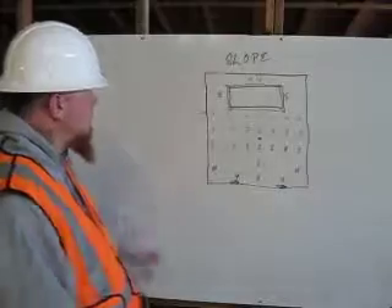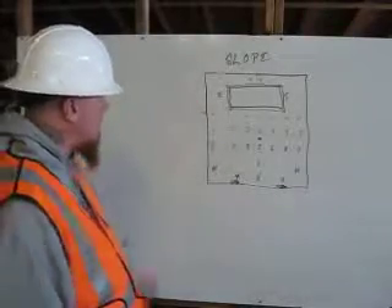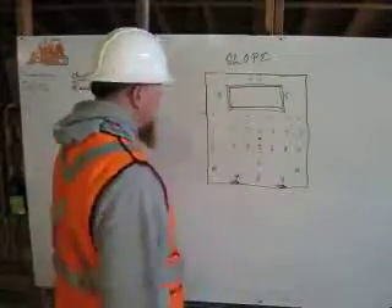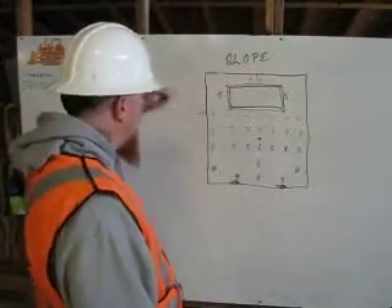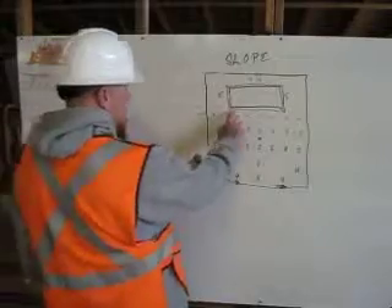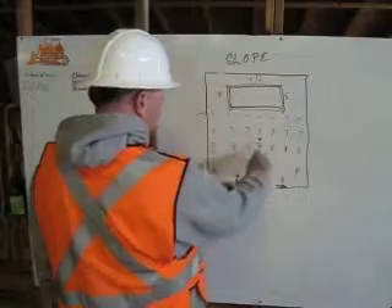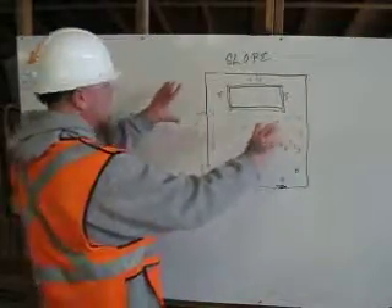Here on our demonstration, we're going to be setting up in a parking lot here with the slab in the middle where our building is going to end up sitting. So in here, we have four feet in the front, two feet in the back. We're going to set our transit up here through the scope here in the middle. That way you're able to get a better view of the parking lot.